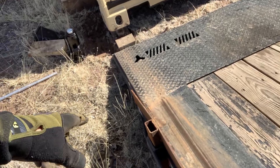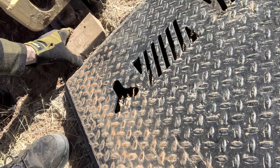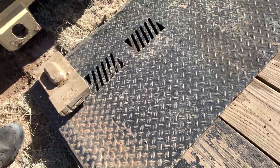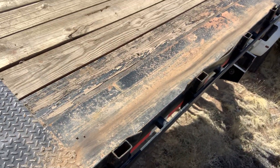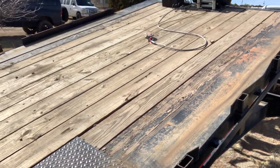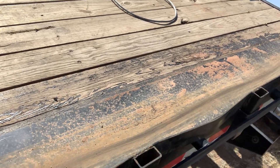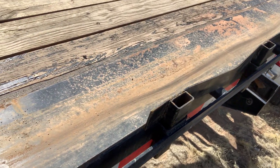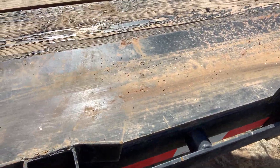I want to get clearance enough to get this to about right here, then lift. I'll move forward and put these blocks in place because they do a phenomenal job keeping my deck free from extra wear and tear. You can see my deck where I just slid this off — I had the pucks underneath. They're plastic and dirt granules can get in there a little bit, but it's much better than metal to metal. If you go metal to metal you start grinding out the 10-inch wide by quarter-inch thick steel really fast.